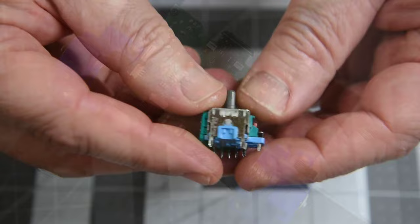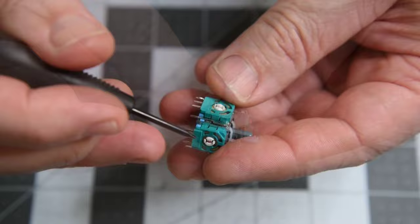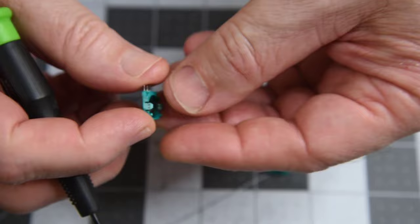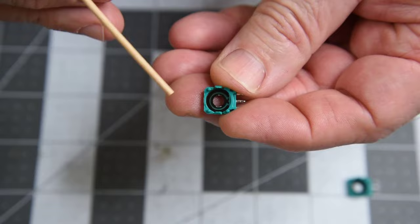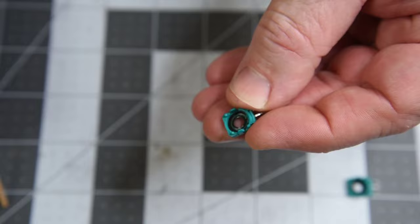Let's see what we have here. These are made by Alps — seems Sony is using the same manufacturers for the PS5 joystick parts as the PS4: Alps and Favor Union. Let's pull the potentiometers off and see what we have. I did try a cleaner on them with no luck. That looks like a problem right there — some of the center contact material is missing. That area should take less wear than the outer contact material, so maybe it's a defective resistor element or a wiper that had rough edges on it. Looks like it might be a pretty rare failure — at least I hope so.